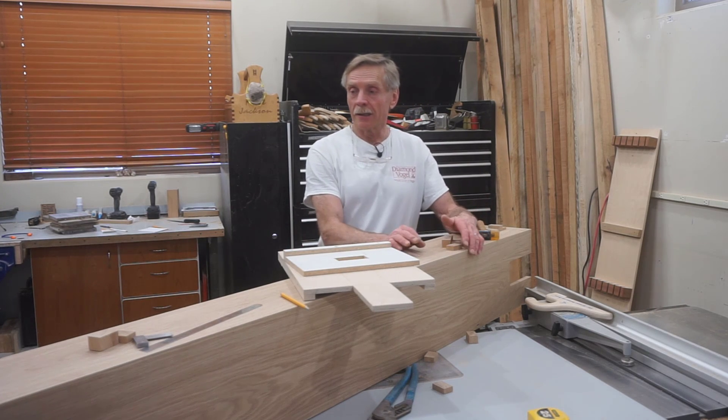The template has a fence or shoulder to index it to the beam and a pencil mark that lines it up with the end of the beam. Using the template is merely a matter of indexing this fence to the corner of the beam, lining up the pencil mark to the end of the beam, and clamping it in place with steel screw clamps. The weapon of choice for this operation is a Bosch Colt router with a five-eighths-inch diameter, half-inch cutting length, quarter-inch shank, top-bearing flush trim bit — set to about three-quarters-inch depth so routing through the half-inch-thick template leaves a quarter-inch-deep mortise. I do a quick preliminary routing, blow out the chips with compressed air, then finish up to make sure the edges and bottom are clean.